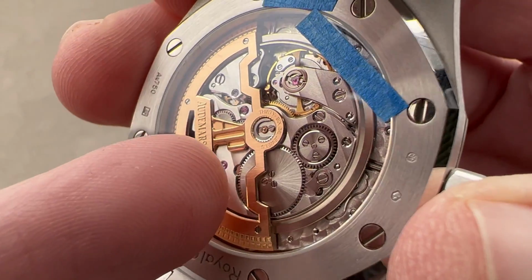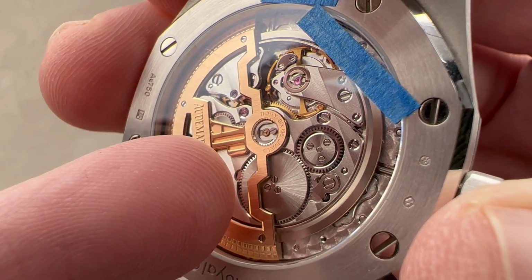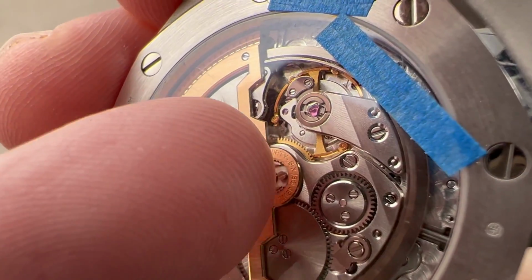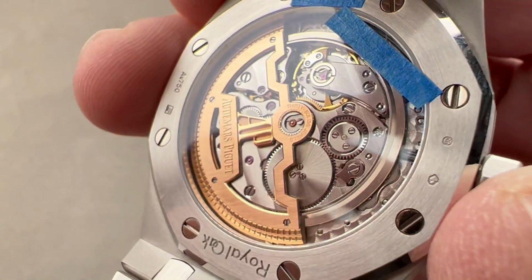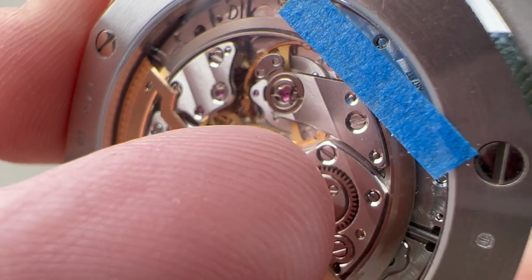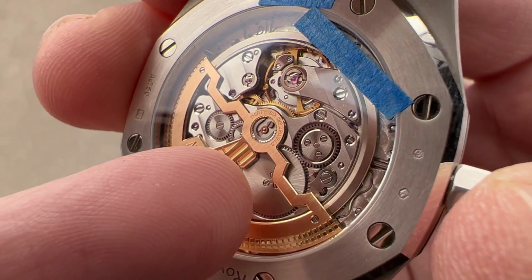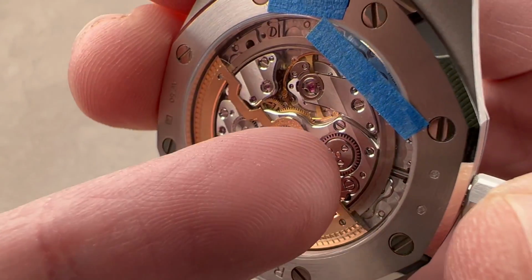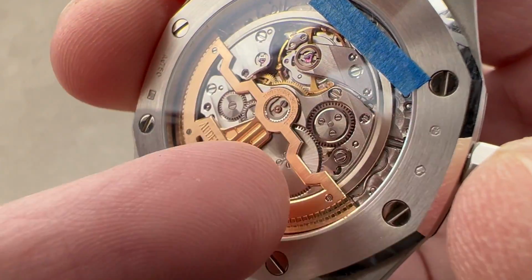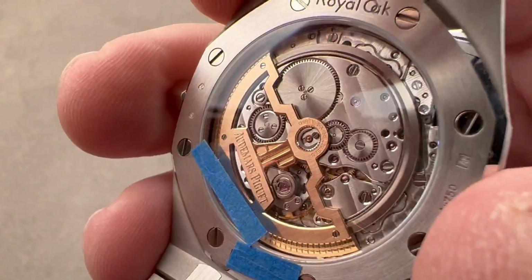Now, it's a unidirectional winder with a beat rate of 19,800 vibrations per hour, 40 hours of power reserve, 36 jewels, and you can see a Gyromax style free-sprung balance for durability and precision of adjustment. Take a quick look at these bevels. These are some of the finest you'll find on any AP watch, and it's telling that the new jumbo no longer includes this movement. While the new movement might be larger and more modern, it also lacks the beauty and the truly detailed manual level execution of details that you find on these older JLC-based AP 2121s.